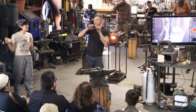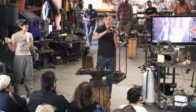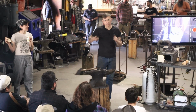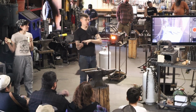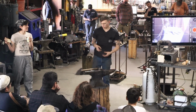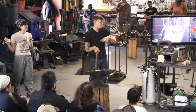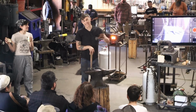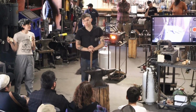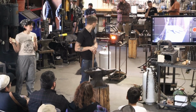the general pulling motion that you might want to do with a knife, you want to have some kind of a positive grip there, especially with slippery hands. I can always crush it later, but I'd rather leave it a little wider. I like to say it's like toothpaste in a tube. Especially on a stock like this, whether it's a knife or something else, once it goes out the end, it's not going to be able to be put back. And so we want to make sure not to forge too long, too early.